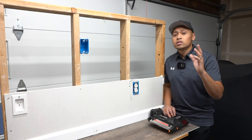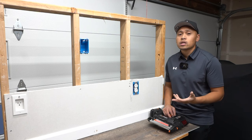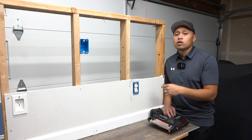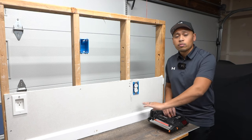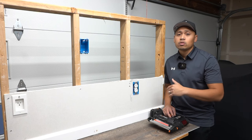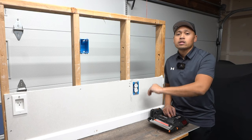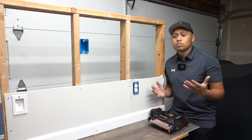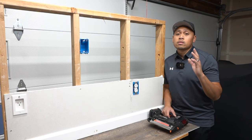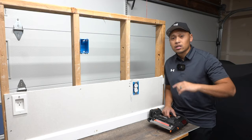So like what I mentioned before, this technique is not meant for everybody, but it's worth taking a try to see if it works. Sometimes those brad nails are dug in deep in there, and you might have to dig through your baseboards to find those nails and take those out using some pliers or whatnot. Then you'll have to patch all those damages with some wood filler, sand it, and then repaint it. That's just how the nature of this project is. Sometimes you get lucky and it's that easy, but sometimes it's a lot harder. Let's get to the next technique.